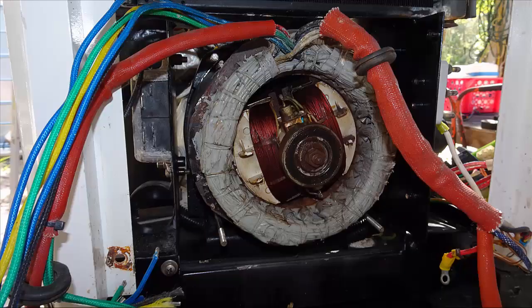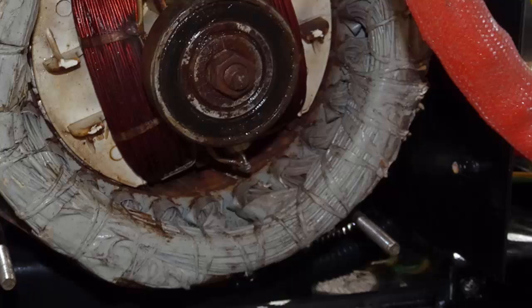As shown in this picture, we must also consider the outside diameter of this protrusion of wires extending beyond the edge of the stator housing. These wires consist of the actual windings that are jumping from one slot to the other, and also all the jumpers that connect all the windings. So these are physical issues we have to consider when we wind these coil windings.